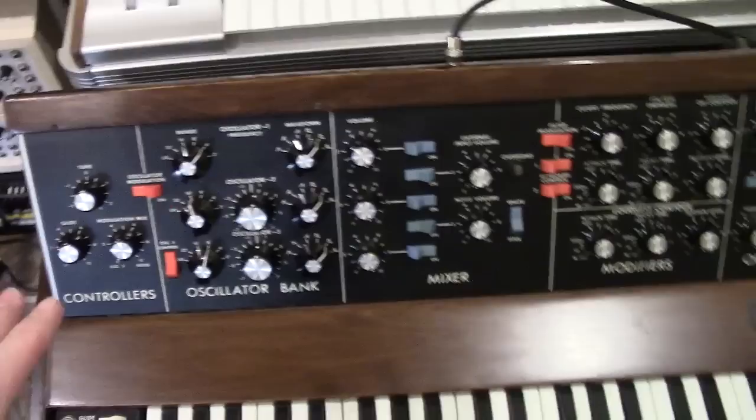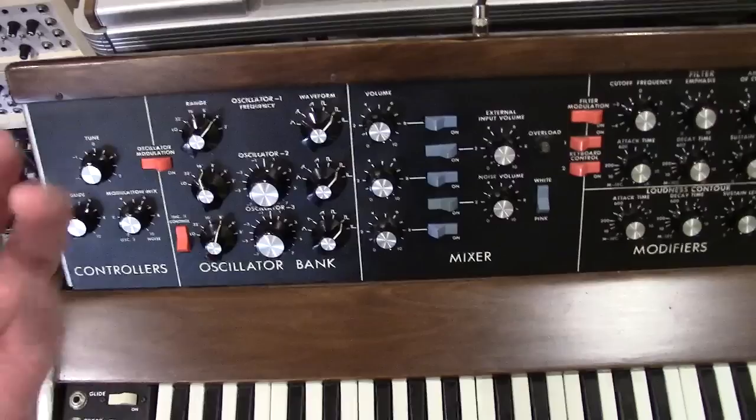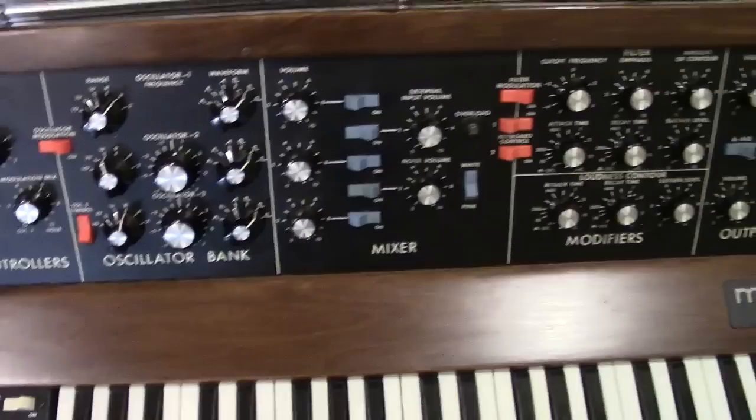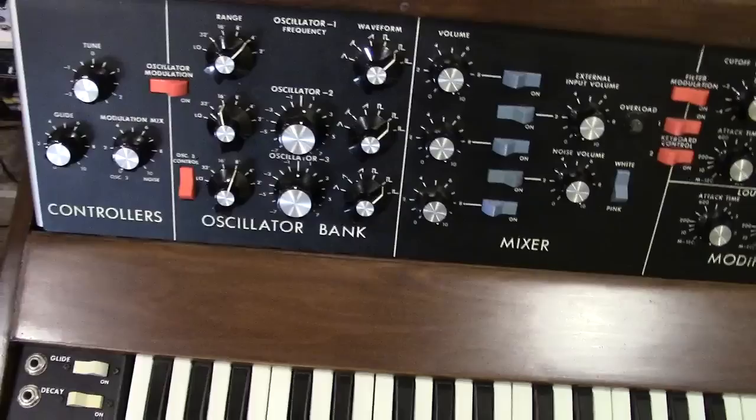You can usually tell this if you see a green pigment on a connector — it works its way outside the ends of the wires into the actual connector pins and you'll see this green colored tint. It's actually the wiring itself. So what I ended up doing was pulling the harness and actually rewiring some of it, putting new wiring in — matching color, of course — so everything still matches the schematics. Fixed that, and now it's working great.